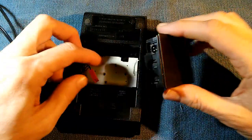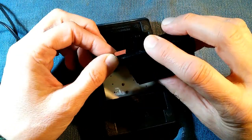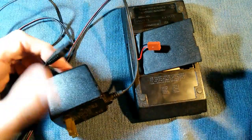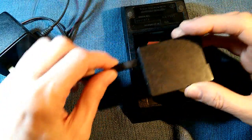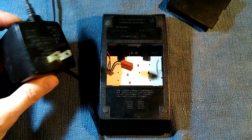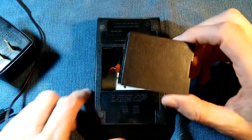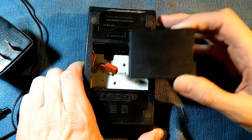The way this battery pack connects to the calculator is through a three-pin connector right here. It can only go in one way and connects like so. The calculator also has an AC charger that plugs into the battery pack, which in turn plugs into the calculator. The power supply puts out 5.7 volt AC — there's nothing inside except a transformer. The battery pack acts as the rectifier, so if the battery pack has gone bad, you cannot run this calculator off the AC power supply.